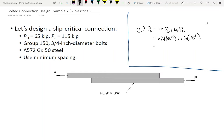That's a good question. No, because that filler plate is not providing load. What I'm getting at is, in order for it to be double shear, if you had a plate and then a filler, you'd have to be yanking like this, and then yanking like that, and then yanking like that. You're not doing that with an internal filler plate. That's a really good question, by the way. Does that make sense? So, no.